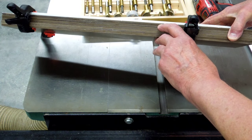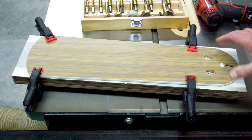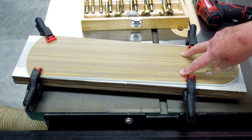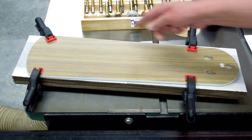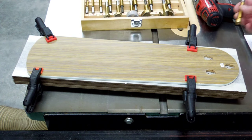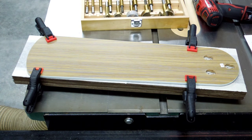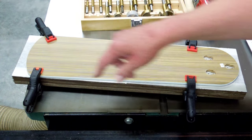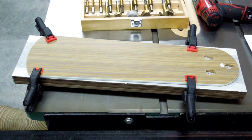After laminating two pieces of 1/8 inch hardboard to make up the five sets of blades — this is a 1/4 inch thick material — I stacked these and attached them to each other with pieces of double-sided tape. Using an original blade I marked the outline. I took the bits, chucked them up in a cordless drill, and spun them backwards to mark the center points. This is the most critical end — I'll drill that out with a good brad point bit and then come back and drill the others. After all the holes are drilled I will cut these to size and cut the flat parts out on the scroll saw, round over the edges, and that will be the project.